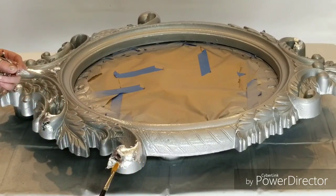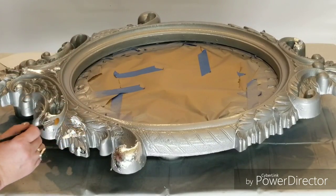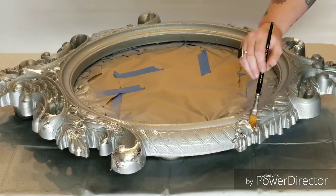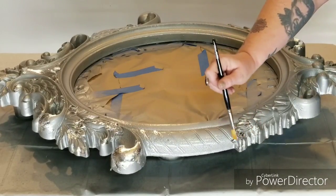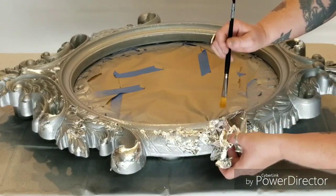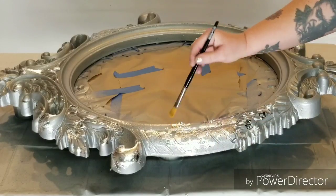Now if you were doing a smooth piece of furniture you might opt to use full sheets of the silver leaf and apply them in a glass-like surface. But like we've said, this is a textured surface and we're really going for detail on it, not completely silver leafing. What I'm doing here is applying the silver leaf to all of the high points to give it a nice decorative finish and then working it gently into all of the crevices using the soft brush. This stuff is super thin and very flaky — I take a piece, stick it onto the tacky surface, and then move the sheet around and rip it so I don't end up with the straight edges that are cut out from the squares of the silver leaf. I'm not wanting that effect.